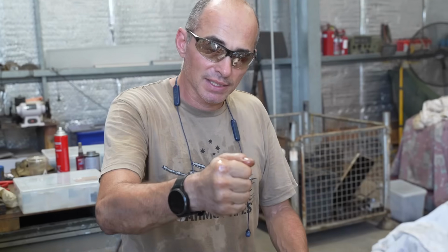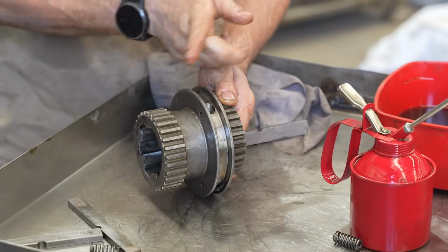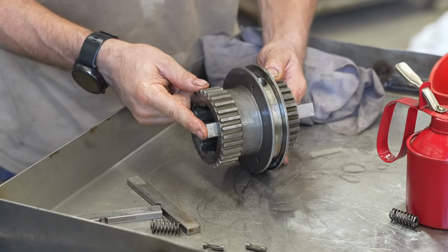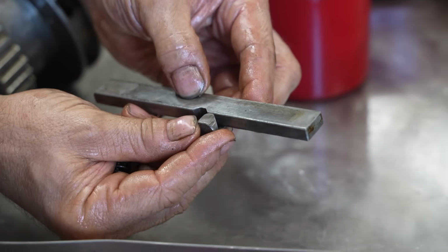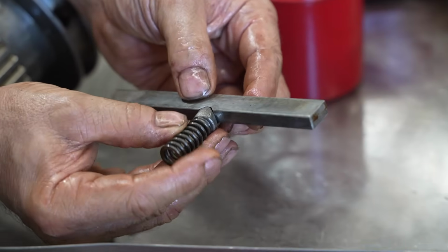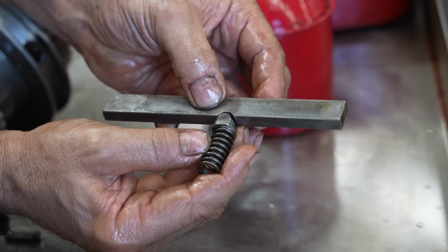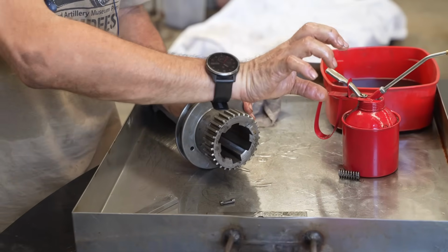When you go to push it into gear, this synchronizing sleeve gets pushed in the direction of the gear, right? And these sliders, synchronizer sliders, I guess you'd call it, are spring loaded with a cam. In order for the slider to move, it's got to overcome spring tension. So when you push it in the direction of the gear, there's going to be a certain amount of tension on that to push the spring backwards, which allows the synchronizer hub to actually go and fully engage with the gear.